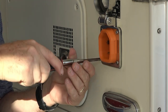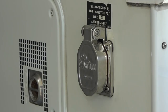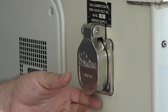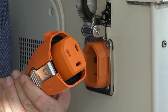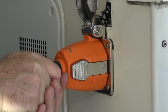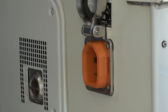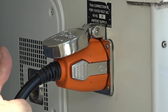Now I'm going to tighten — yeah, that's nice and tight. We're all set. Now let's try the plug we did. Nice stainless steel cover. Remember, this is the 30-amp version — there is a 50-amp as well. There are these clamps, and there's a lock here and here. When you push it in, these pop out and then you shut that — there's no way it can come out. There's no way you can misalign it: straight in, straight out. Much better than the way it was before. If you've enjoyed this video, please remember to like and subscribe for future videos.